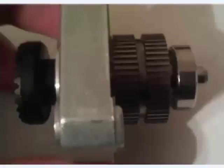Here's a closer picture of the rotor where you can better see these ridges that kind of look like gear teeth. And notice that there are 2 sets of these ridges right next to each other. If you look closely at these 2 sets of what look like gear teeth, you'll notice that the teeth on the top disc do not line up with the teeth on the bottom disc. That's actually a very important point to note in understanding how a stepper motor works.